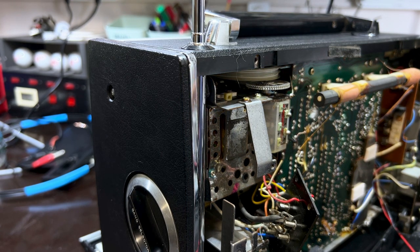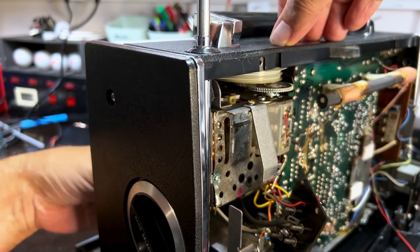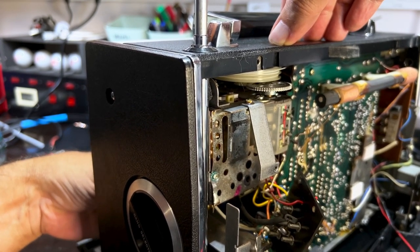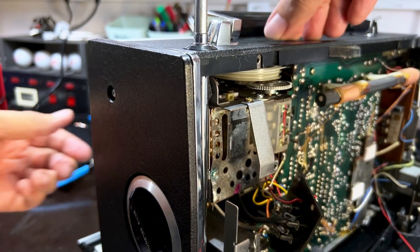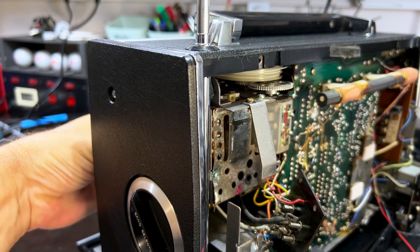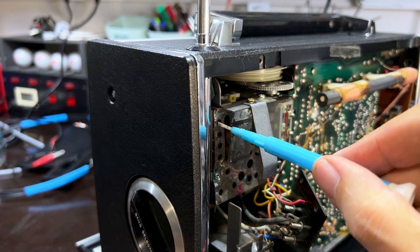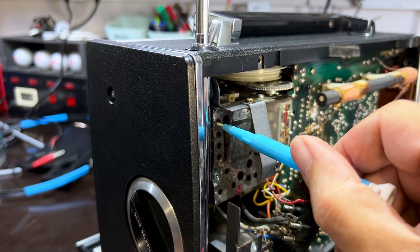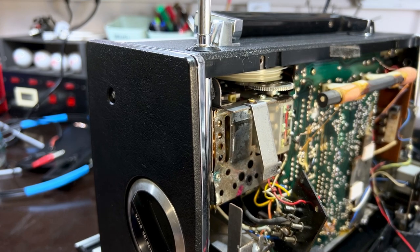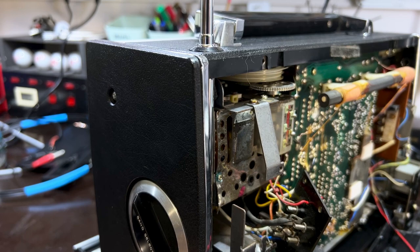So let's put it at 108. I'm going to tune it to 108. Let's give it some audio. It's at 108. Put that down so I can put the volume up and see it on the meter. And now we're going to try CT101, which is that first one on the left here. Sort of going, it's peaked. It's going down ever so slightly. And CT104, is it? 103. So it's the third one down. 1, 2, 3. It's this guy over here.